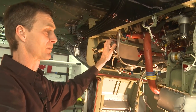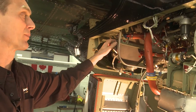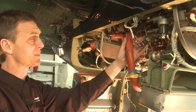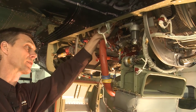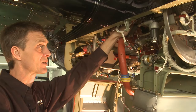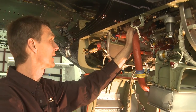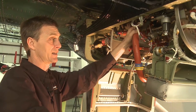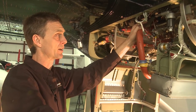As well as being extremely accessible, many of the 400 series components have been updated or modernized. We've replaced things like the fuel flow transducers — now a DC-powered fuel flow transducer — a DC-powered oil pressure gauge, and a DC-powered torque pressure gauge. These components are found to be smaller, lighter, and more reliable than some of the original components that were on the Twin Otter.